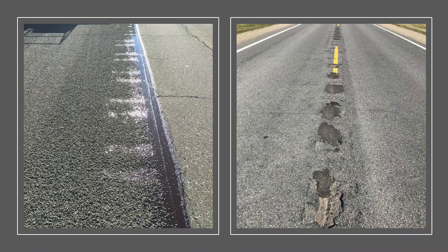Just a couple of photos showing filling the rumbles in with a chip seal. We found that even a double chip seal, we still get some benefit from those centerline rumbles. The photo on the right is where we tried to regrind rumbles back in after chip sealing, and you can see the deterioration at the longitudinal joint. A lot of times these pavements, that's the only issue — there really isn't that much transverse cracking, but it's the longitudinal joints that give us problems, especially as we're doing subsequent CPM treatments over old ones.